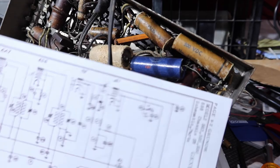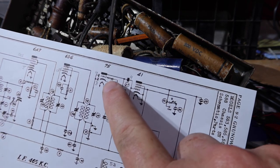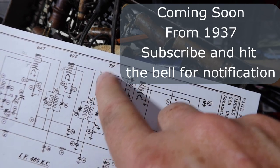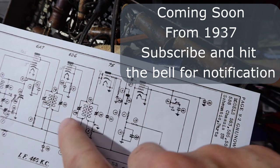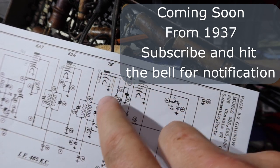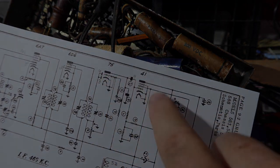So tube 75 is right here. And I'm looking for pin 3 and 4, which are together, which is the output of the second IF, to see if we're getting the signal there as well. And then if so, then we'll be into the audio chain here.